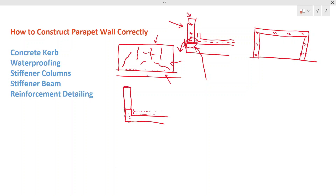When constructing the parapet wall, you might consider using concrete for the full wall, but this may not be economical. In big projects you might use concrete, but mostly we use brick or block. Using concrete requires formwork and reinforcement, which is a considerable additional cost compared to brick. With the concrete curb at the base, water leaking issues will be resolved.